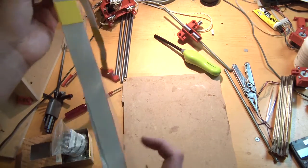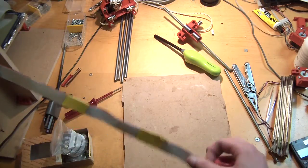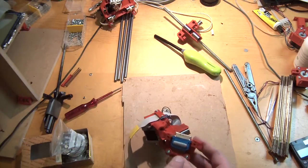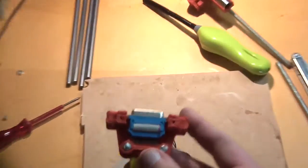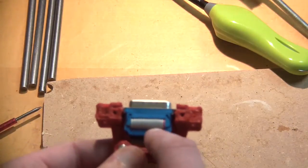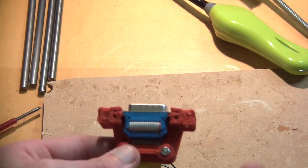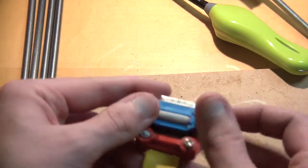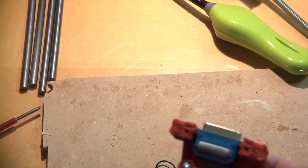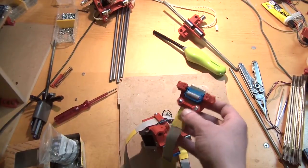Here you have to attach your polypropylene sheet as well. The cable is going to run like this, so the polypropylene sheet has to be on the inside to enforce the minimum bend radius. The same is true for this small cable. Then you have to attach the ribbon cable to this female plug. You just lay the ribbon cable across it — there is a lower part, a middle part, and an upper part. You put the ribbon cable in and then push the middle part in really firmly. It requires a lot of force, but there are knives that cut through and make contact with all of the wires inside your ribbon cable. It's pretty self-explanatory once you've done it once.